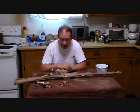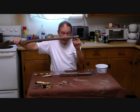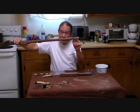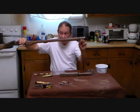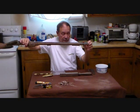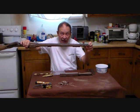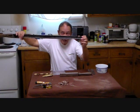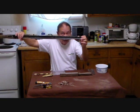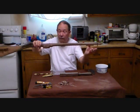Now, about other things. This swivel, okay, we changed up the design of the Brunswick rifle. Actually, this is a barrel lug. It should have a slot in it like this. We drilled a round hole through the stock and through the barrel lug and out the other side to attach the sling swivel. So this strengthens the stock and it goes through the barrel lug. Yeah, so it's retained by metal just like it was originally, although I did cut the original off.